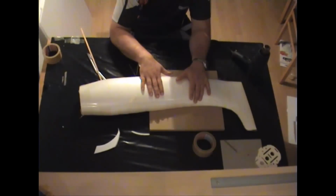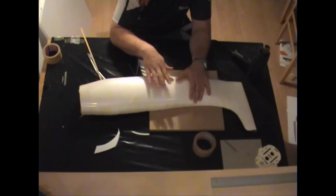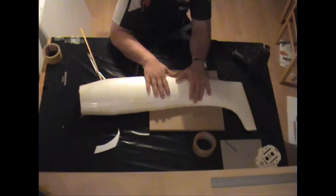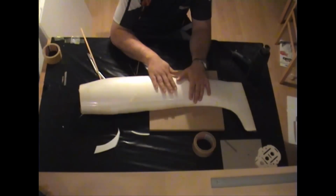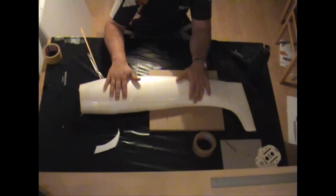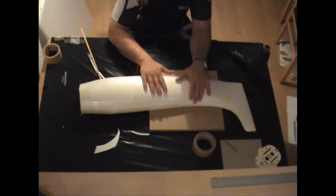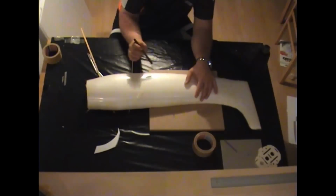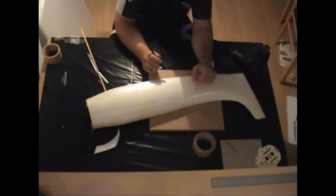Depron is also an insulation material, so it is important that you make sure that the heat is going all through the material. Not to burn the Depron, you would have to give it time to transfer the heat through the material and get all weak. This takes much time. So take yourself the time and carefully and systematically fan this with a heat gun or with a high power fan. Make sure that every region is reached by the heat.